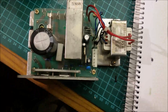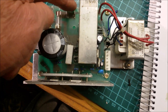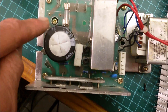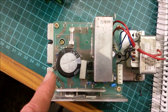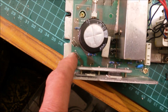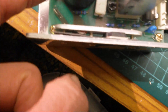Looking at the control board, we've got live in — those two connect together — you can see the gray of the copper track underneath, through a fuse. Then neutral in goes directly to one end of a bridge rectifier, which is under there. You've got the positive and negative output from the bridge rectifier. The negative goes into this box which contains a lot of workings. The positive goes to one end of this huge electrolytic capacitor. They come out here as positive and negative output to the motor — labeled M plus and M minus.